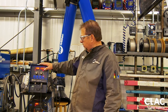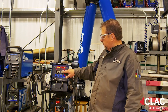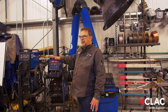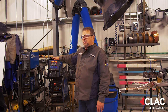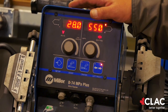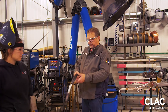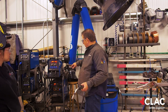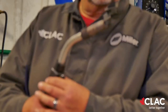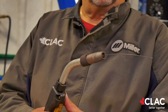On the top part of the machine is where she sets the voltage and wire speed. She's running 28 volts, 550 inches a minute — the 550 inches a minute is amperage. She's going to be welding super hot and super fast. The wire is fed through a four-roll drive system. Everything happens when you pull the trigger on the gun: the gas turns on, the wire starts feeding — it's semi-automatic.